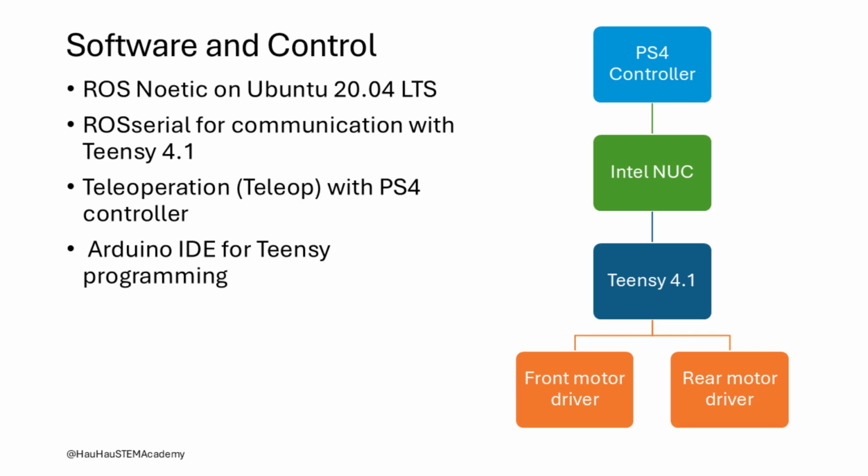Currently we are using ROS Noetic and ROS Serial for communication with the Teensy 4.1 microcontroller. All motors are individually controlled and the base uses skid steering for turning. The microcontroller was programmed in Arduino IDE. For the teleoperation we use a PS4 controller. A more detailed video on the ROS setup and teleoperation will be part of my next videos.